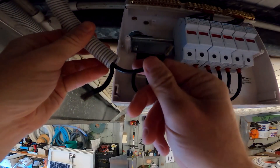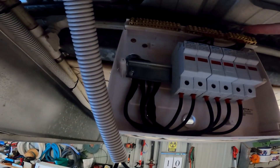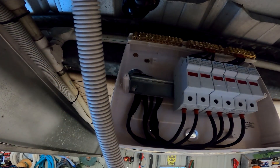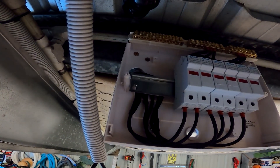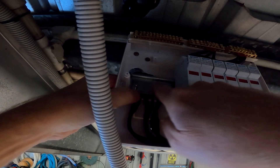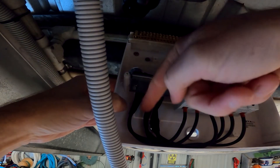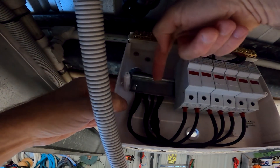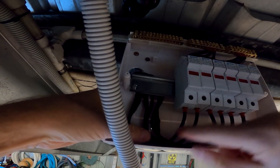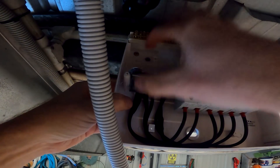It's always too short or too long. I've also tried to push these cables under the DIN rail because eventually we'll have four more fuses in here and you don't want cables in the way. Always try to get your cables under the DIN rail so they're nicely tucked away — then you won't have any problems later when you add more fuses.